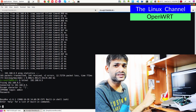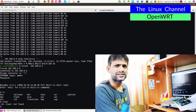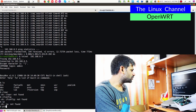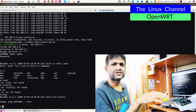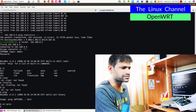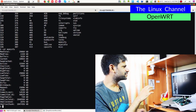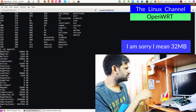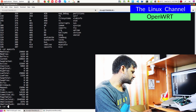This is not OpenWrt — I'd like to mention that once again. Of course, there are very few commands that are going to work and many are not. The clear command is not working, there's no ifconfig. The ping command is there, shown as part of BusyBox — not like our regular Ubuntu Linux or standard desktop distro. We can go to proc — proc is supported. We can print cat meminfo and you can see the total memory is around 32 MB, it shows as 29 MB, maybe something is shared.